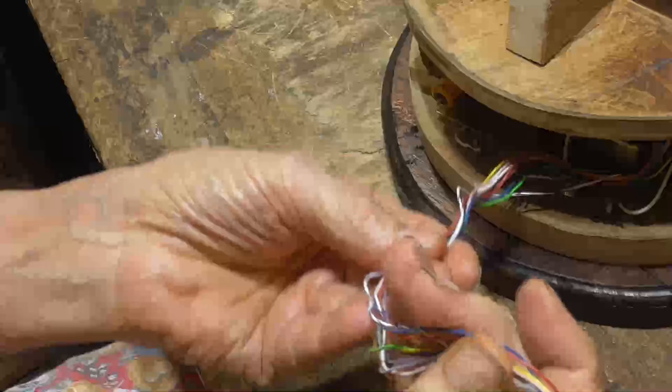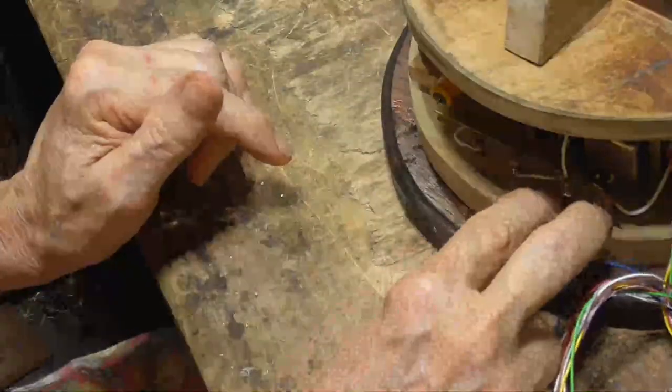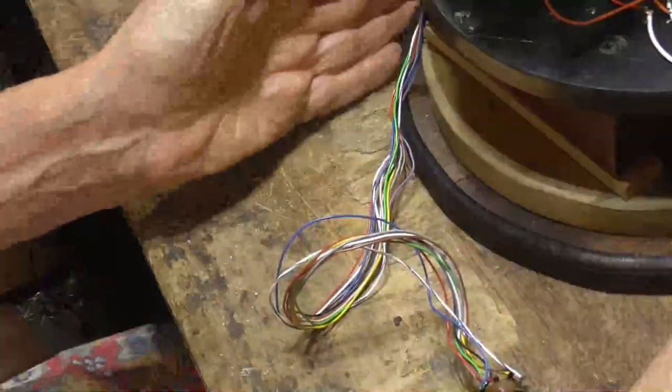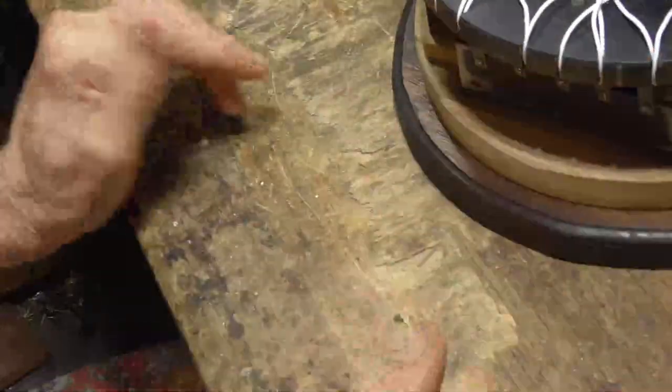So what we have coming out of the Nixie, we're going to have our control wires, which are completely isolated from 120 volts, and we're going to have our plus 12 volts in COM, which go to this same board. That's isolated completely from the 120 volts. Then here we have standard 120 volts to the line. You can plug it in either way because you don't care whether the circuit itself is hot or grounded. Everything that's in there is closed in by the glass case so that you're not going to get shocked. Okay, that's how the electronics works.